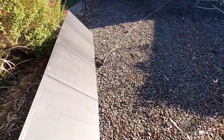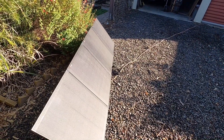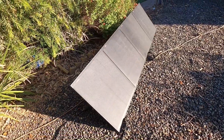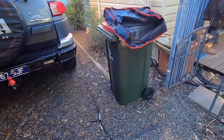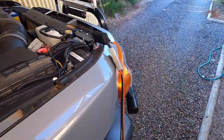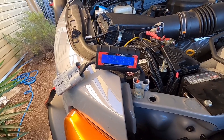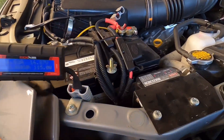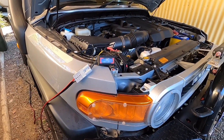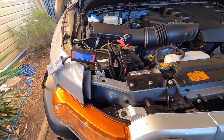The battery is charged and the panels are now in pretty well full sun. It's not the most optimal time of day but as the sun gets a little bit higher you can move the panels around. They're performing great. I'm going to plug the Travel Buddy oven in later as well as the fridge - and remember that's running over a 10 meter cord to get them into the sun. It's now sitting at 114-115 watts and 7 amps. That's putting in good voltage and will keep that battery fully charged.